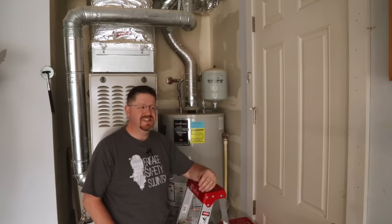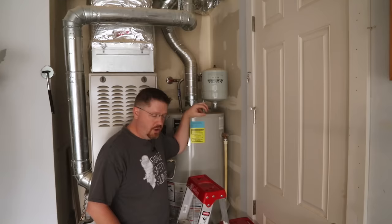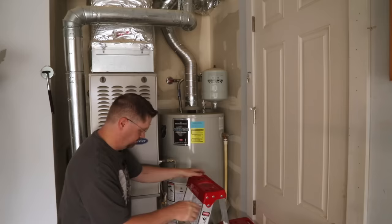It's been draining for about 15 to 20 minutes and the tank is basically empty. But the drain process is gentle and doesn't really agitate the sediment at the bottom. So before I finish, I'm going to open the cold water inlet for about 15 to 20 seconds to spray cold water to the bottom and agitate whatever is down there, then let it rest for 15 to 20 seconds and let some drain out. I'll repeat that process three or four times.